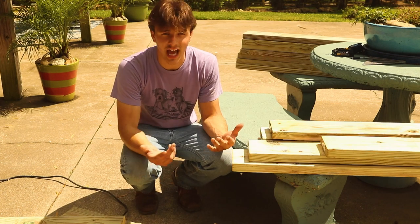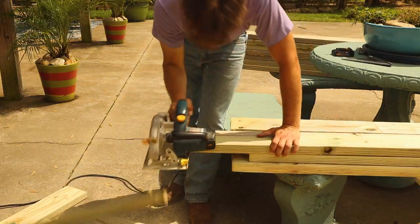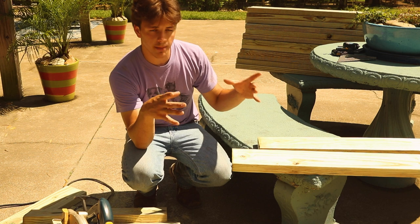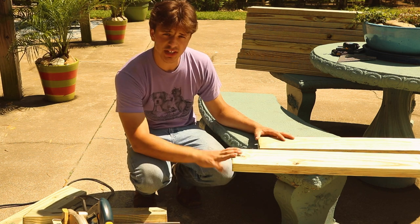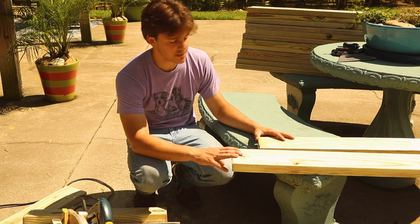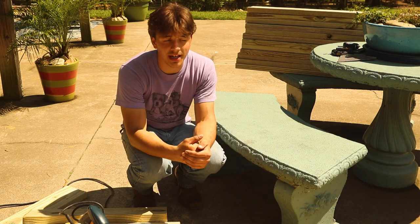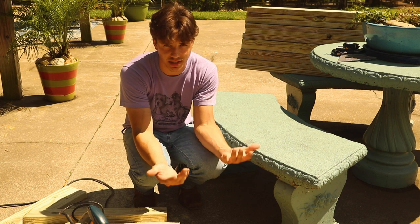You ever have that feeling when you just cut half a dozen boards and you're like, I really hope I made those measurements right? Alrighty, so we have all the main boards for the actual frame cut — they're all cut to six feet, so that's 12 boards at six feet long. These two boards we're going to save till the end for the rafters. Next, we have to cut these four-by-fours to six feet long. And let me tell you, if you can get a six-foot four-by-four, just do that — it's so much easier than trying to cut these things.